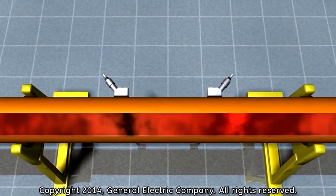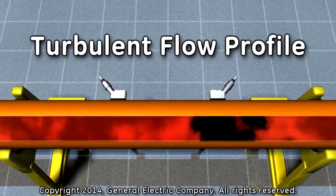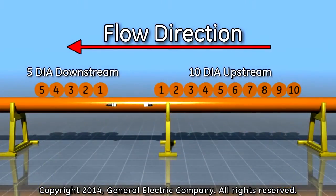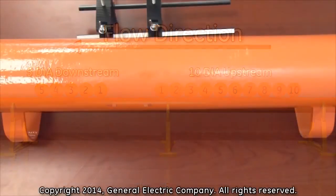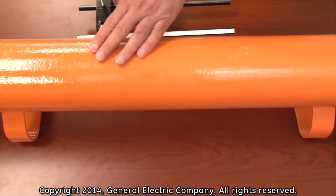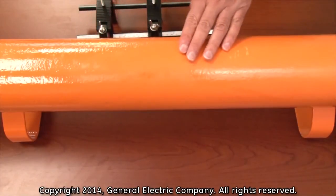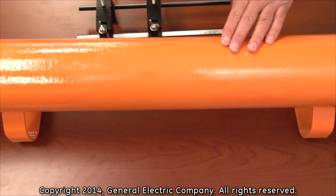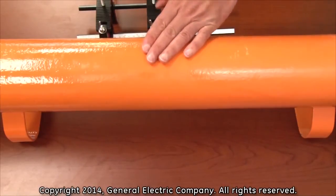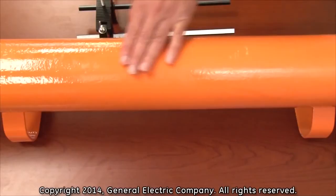In order to ensure the best accuracy for flow measurement, you must have a turbulent flow profile. You can achieve this by having at least 10 diameters upstream and 5 diameters downstream of straight run for the transducer locations. The location of the installation should be clean, flat, and free of any debris or buildup of corrosion or pits. This ensures good coupling of the transducers to the pipe material and better sound propagation of the ultrasonic signal.